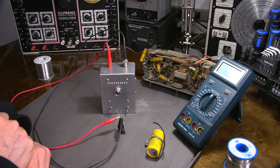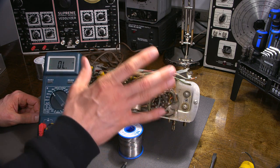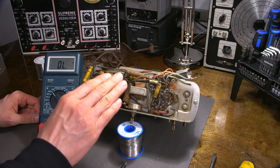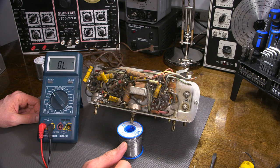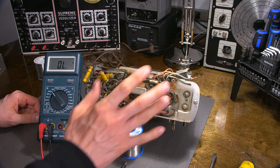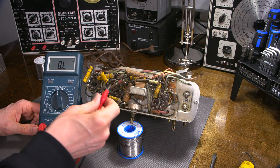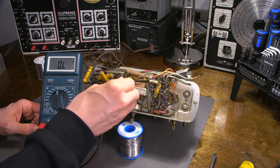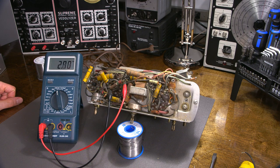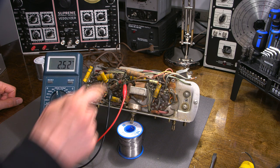Let's test some of the resistors and see what they read. Since this is a vacuum tube circuit - which is high impedance - much of the time it's okay to test the resistors right in circuit without removing any leads. This isn't the same for solid state circuitry but it works very well in a case like this. Let's test this one first - it's 2.2 megohm, red-red-green. Going to the 20 megohm setting. Not too bad - it's a 10% resistor, it's a little bit beyond, but to tell you the truth that's going to be just fine in circuit.